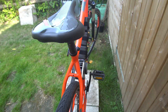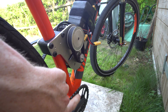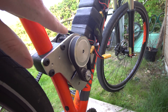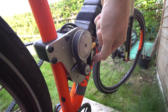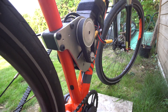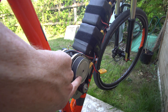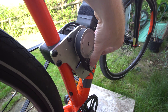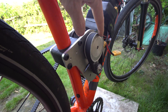On the other side, this is where the motor actually mounts. There's a 20-tooth pulley on the motor and a 40-tooth pulley on the secondary drive shaft — so it's a two-to-one ratio here. The original belt was 300mm long and needed a tensioner, but I've switched to a 295mm belt which doesn't need one. I also machined the guards off the edge of this pulley because it's a nightmare to get the belt on and off, and the belt never comes off when riding because the guard on the other pulley keeps it tracking straight.